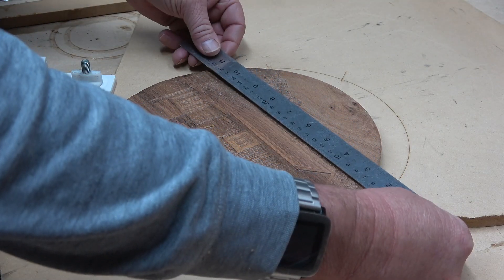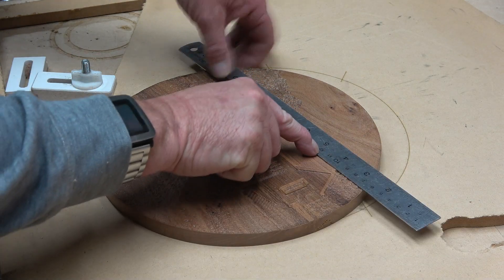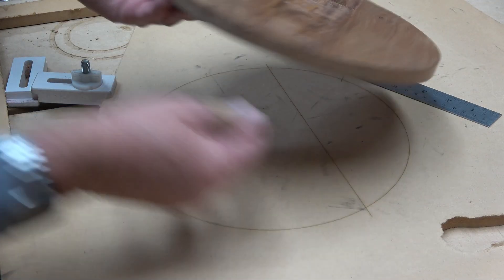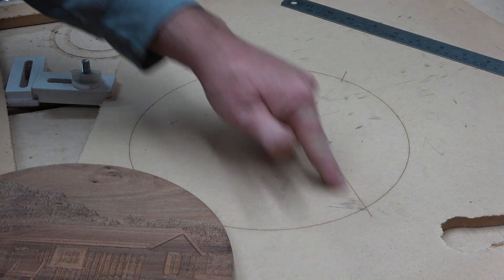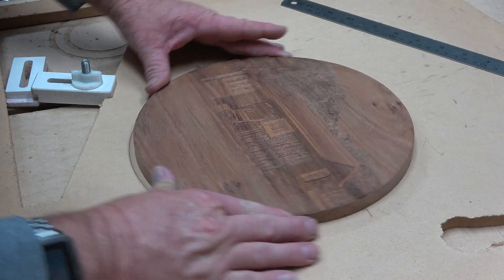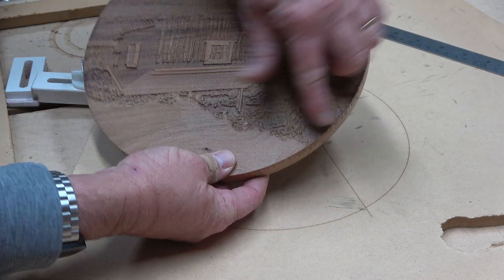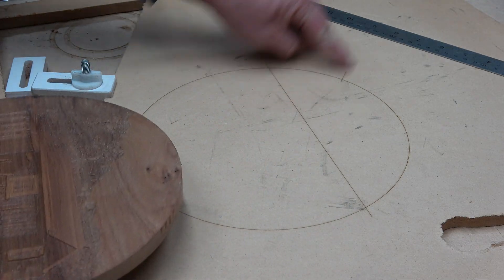The first landmark is the roof line. If I take the roof line and just run it straight through, mark on the edge where it is and then square that down, I can put a line on this side of the roof and a line on this side — that's what this line here refers to, the roof line. I've also added a third line where the sky meets the bush, squared that down as well — and that's what this line here represents.